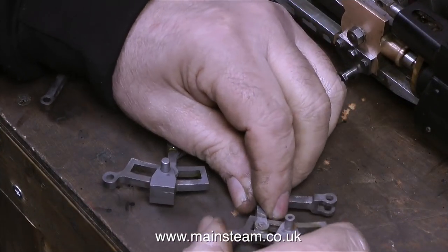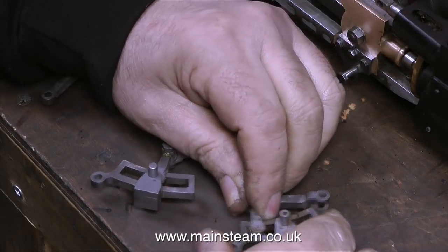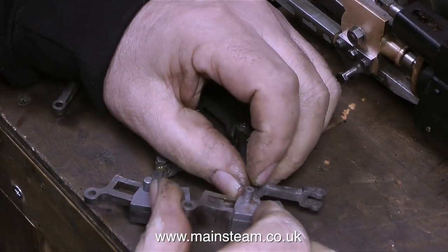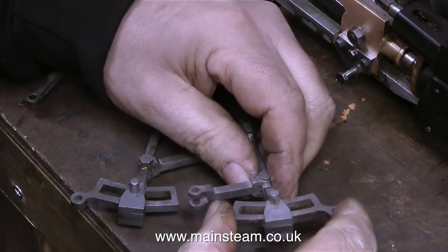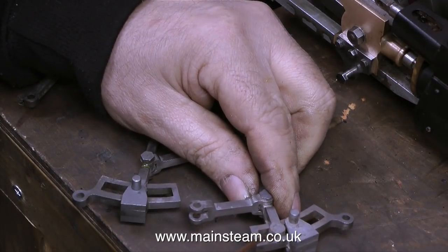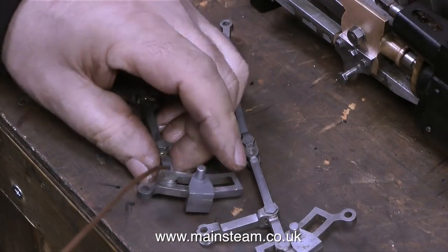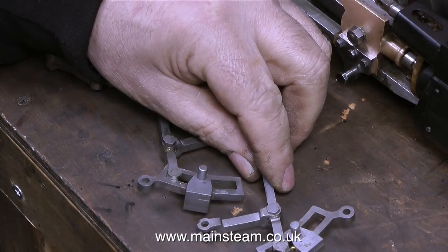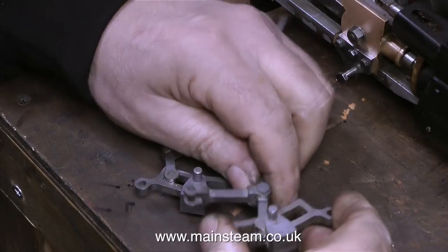All of these parts are just as they were left as I finished cleaning them up. Initially I removed them from the engine very carefully, and then put them into the bead blaster to get rid of the years of rust and grime. Although before using the bead blaster, they spent a couple of days in a pot of cellulose thinners, or lacquer thinner, and I even put them back in the cellulose thinners after the bead blasting operation.